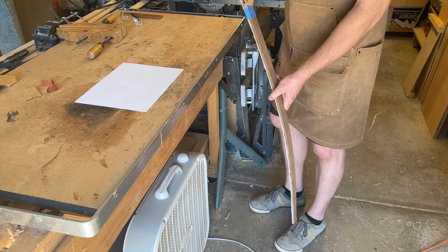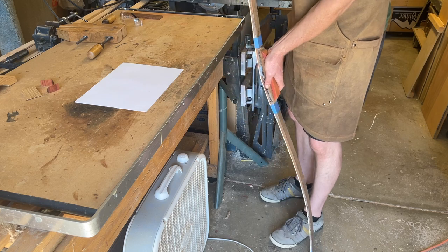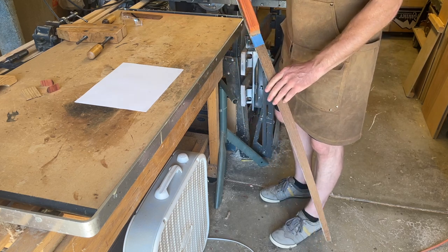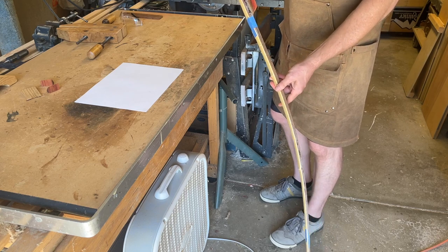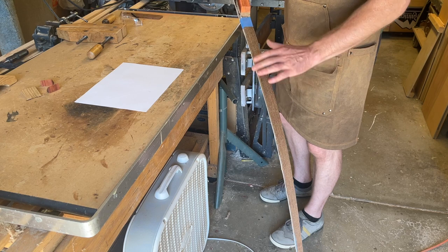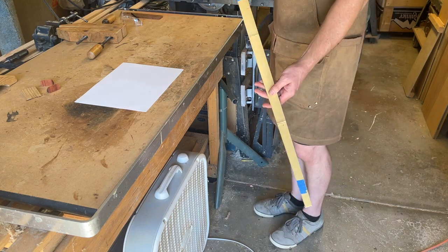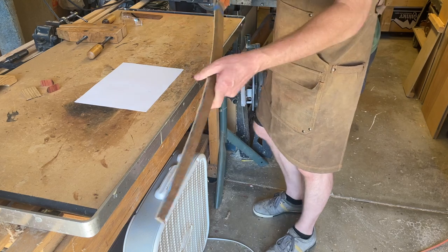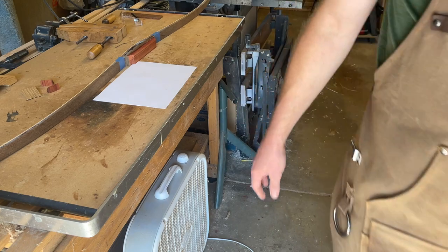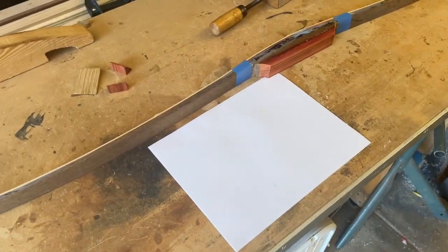Now, since we did that, we are, generally speaking, in our general weight class, okay, so we're already floor tillering rather easily, and so we can get on about faceting out the belly and doing an initial tiller on this bow. And I want to take a minute to explain what that faceting process looks like.